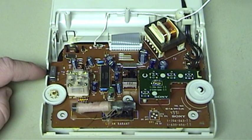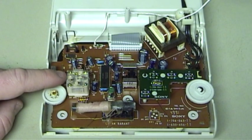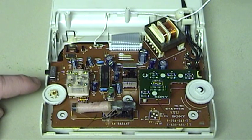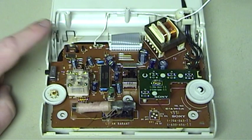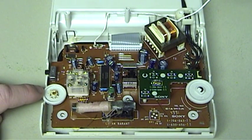This is the AM-FM band switch over here. There is the variable capacitor that allows the user to tune through both the AM and FM bands — this, of course, is the tuning wheel. And while you can't see it here, this operates not only the variable capacitor, but also the sliding pointer in the tuning dial scale by way of a gear train.